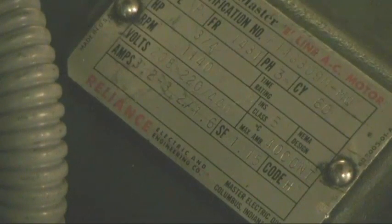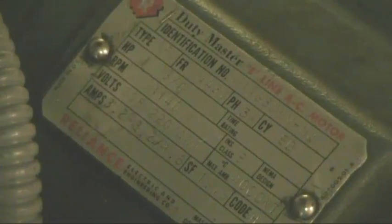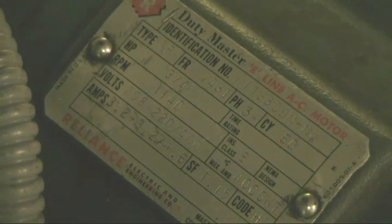If we lower the frequency using a special little tool, the variable frequency drive, we can lower the frequency and push more current into those same number of windings. So therefore we're going to get a stronger field and we're going to get more torque. And again, I say at a lower frequency. If we increase the frequency, then we're going to get a weaker field.